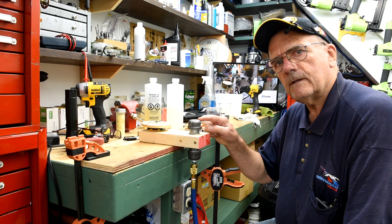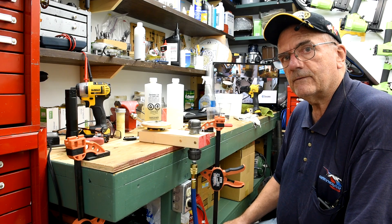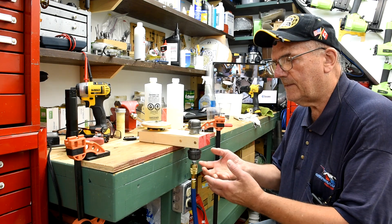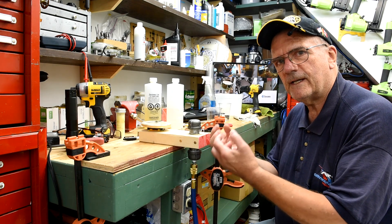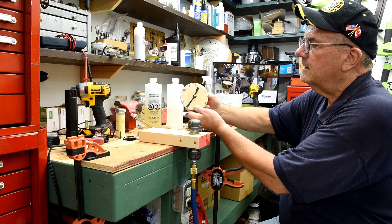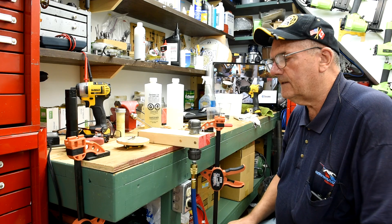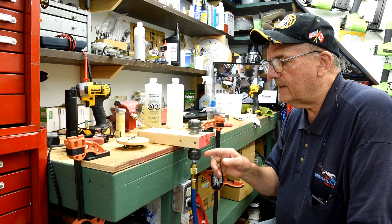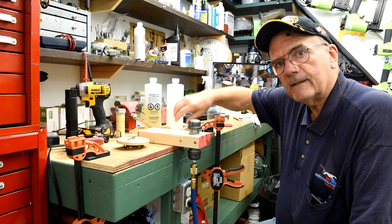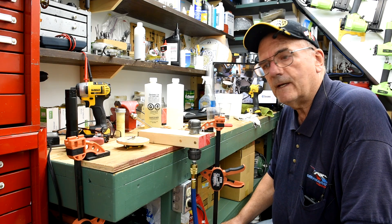It's in there. It's under about 115 pounds of pressure right now. I went through the procedure pretty much the way I had described earlier. The only thing I did differently was I put this on first and then slowly increased the pressure at the tank with the valve. I was a bit worried that even though I had drilled that little tiny hole, it could sort of surge in there. I mixed up the Envirotex about 36 minutes ago. I waited until the Envirotex had completely de-gassed, and then I put that little blank down into the plastic tube just the way I showed you. Then I put the vacuum back on again. I watched for bubbles and there was slight bubbling, but I would say that probably 95 or more percent of the air was out of the blank.